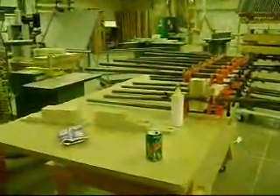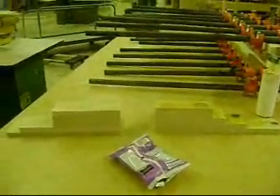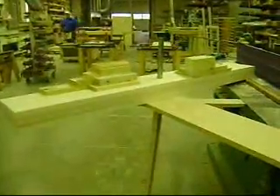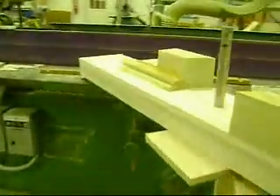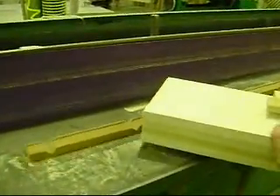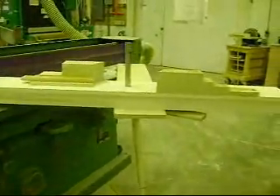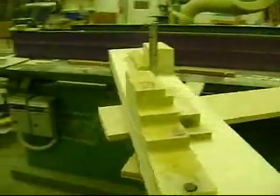Here's the prop glued up, and here are the two little wings that are going to be applied to the prop. This is a 54-inch prop. Getting ready to turn it around — got to go against the belt, make a complete radius, put the blocks on top, and the wings on the bottom of the prop.